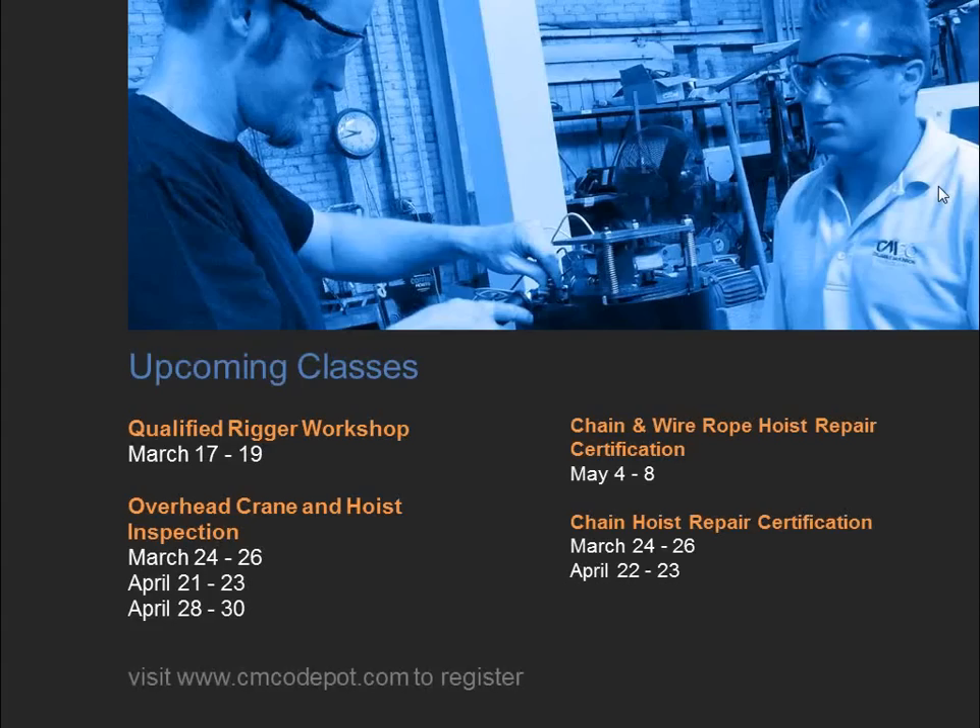A field technician observation: The majority of wire rope failures are found at the top of the equalizer sheave. In most cases, all the factory lubricant is dried out, adding to the problem — the rope is always static at that point and never moves through the equalizer, so it just rocks back and forth, never opening and closing, and the lubricant isn't redistributed. The equalizer sheave is the most common place to find wire rope degradation.